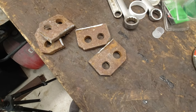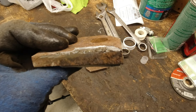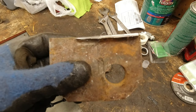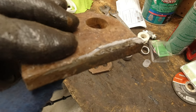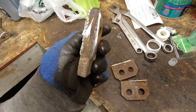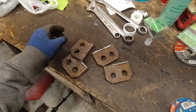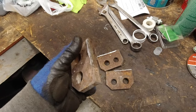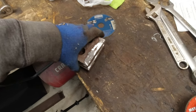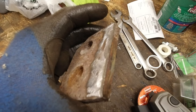It's kind of funny — those brackets came off way easier than I thought they would. The welds on there were complete junk, so I'm going to do a lot better welding than that. I'm going to get these cleaned up, get all the rest of the weld off, and clean up the metal. I got all four of them ground down nice — looking good, with a little chamfer on there too so the weld might penetrate a little better.